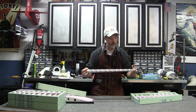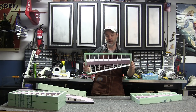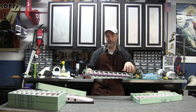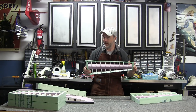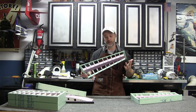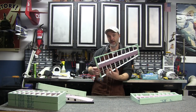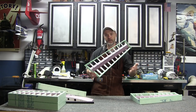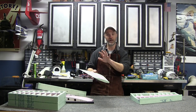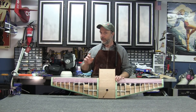The next thing I'm going to do is remove the aft elevator portion of the panel and prepare the trailing edge — I'll add about three hard points for hinges and then line the trailing area with balsa. Once that's done I'll put these back into bed and line the lower surface with balsa. I want to do the lower surface first because there's going to be a hatch in the lower surface so I can get access to my servos and control linkages, and it'll be a lot easier to work on that while the top surface isn't on yet.